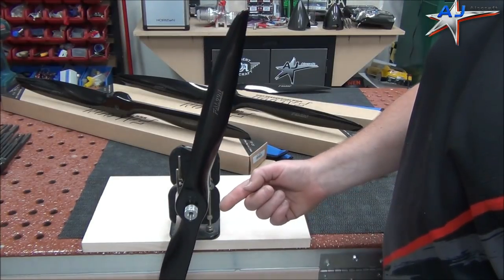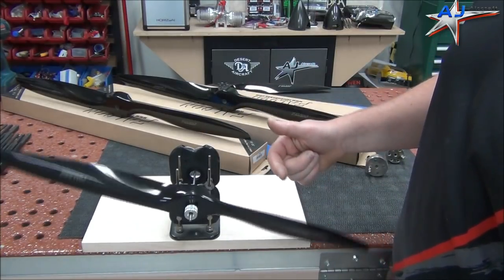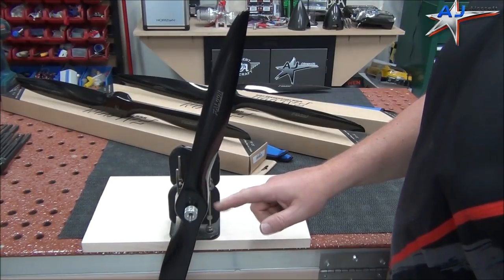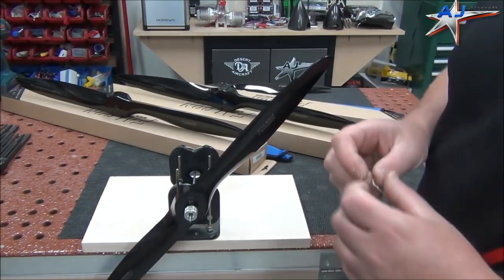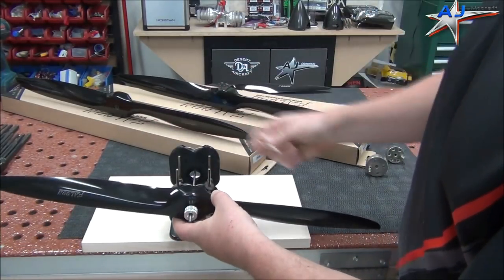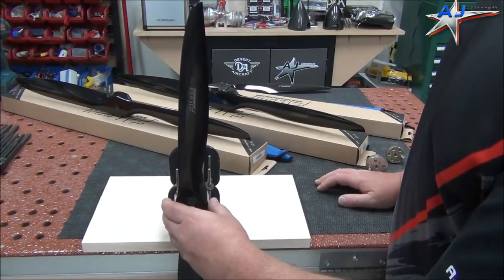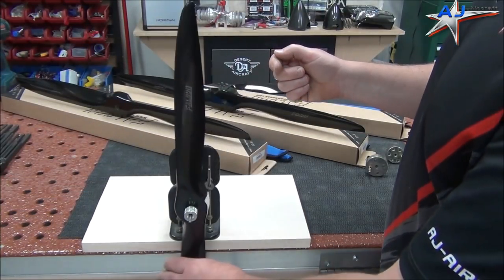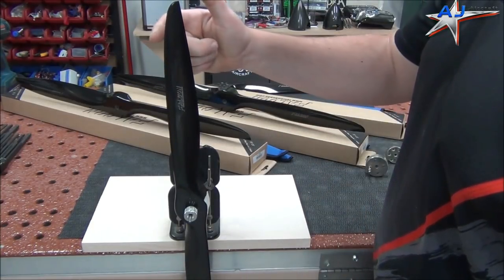Just a little bit on this side. I might take a look at that one — it's definitely a little bit heavier on that side. What we'd want to do is add some weight to this side to counteract that, because it's falling off a little bit more than what I would like. Just to give you a visual on that, I'm going to apply a couple of pieces of tape over here on this side of the hub. Since the blades aren't off at all, I'm just going to put it dead center on the hub. Now with the tape on there, it's standing up good. That's actually perfect.